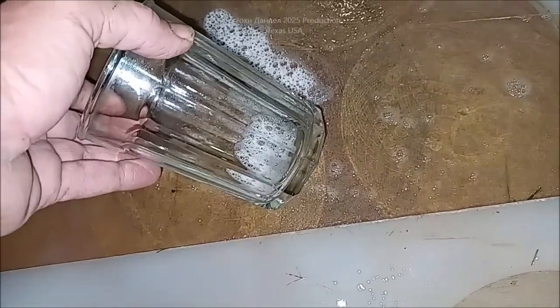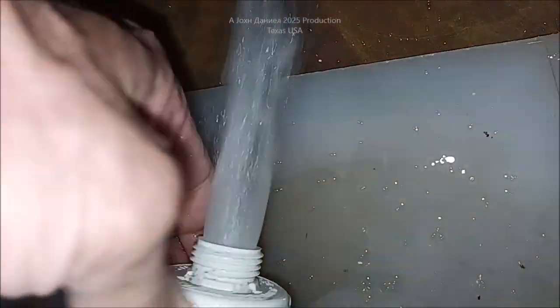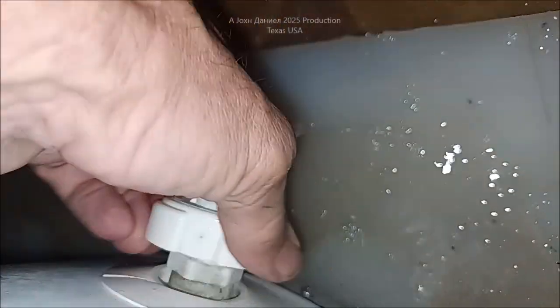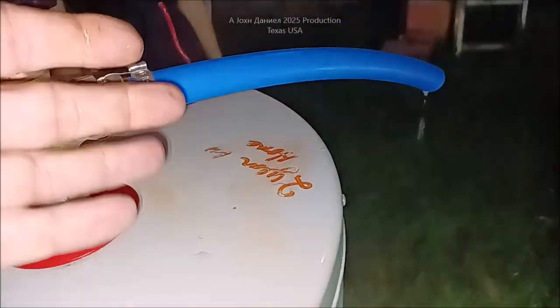If you use a water softener, you'll probably already know it kills elements pretty quick. Look at all the junk coming out of here — chunk stuff, and I have seen rock-looking stuff. Some water heaters can be way worse. But this one, luckily, was in really good shape. It's a 2022 model — three years old. That is your CLR mixed with your lime, and that's why it's foaming up — there's so much lime in it. CLR won't really foam up much on its own; it needs lime to react, like spraying hydrogen peroxide on a wound.